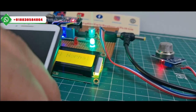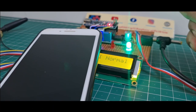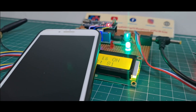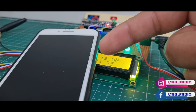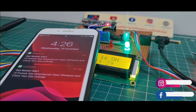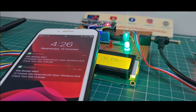I'll show you — I put my hand with hand sanitizer near the MQ135 sensor. You can see it crosses 80%, the red light indicates gas leakage, and the LCD also displays 'gas leakage'. Then the GSM sends the text message to the mobile number. The SMS displays: 'Hi Pratik, gas detected — open window and check your gas cylinder.'